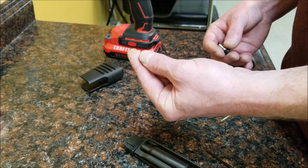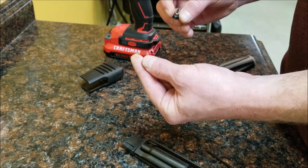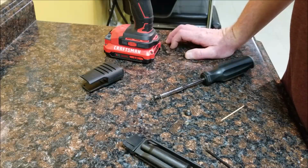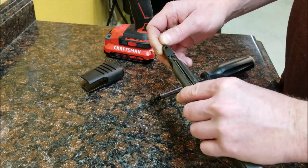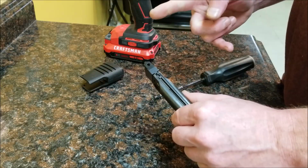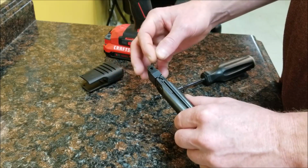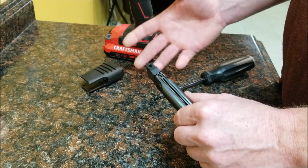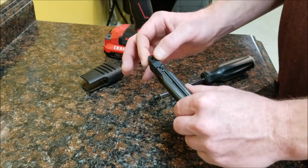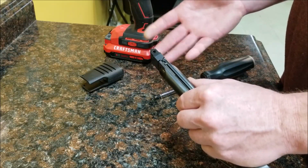And for a long time I thought that it got really cold in the valve body when you're firing the gun real heavy. And what happened was, I have a BB centering done by Drozd, and in some of his early stuff, what he was actually doing was, in the set screw that he would put down in there, before he would do that, he would drill the set screw and press a magnet into it, so it had a little magnet inside there. And one day I noticed it had lost all of its magnetism, and that told me that it gets hot in here, it doesn't get cold, because above 170 degrees Fahrenheit, those neodymium magnets will lose their magnetism.